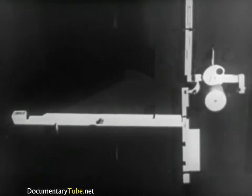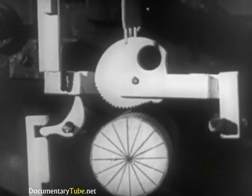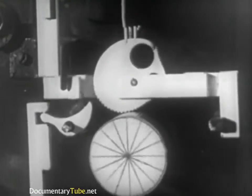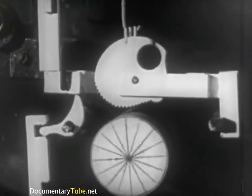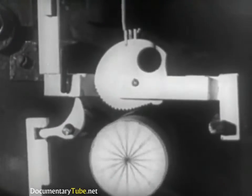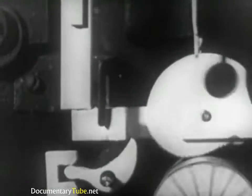Let's observe how the various pieces react to the key. The key moves the lever to which it is joined. This lifts the key bar. In turn, the key bar activates the trigger whose function it is to support the frame with its corresponding eccentric cam. The motion of the trigger allows the frame to lower itself so that the cam revolves around the rubber roller which rotates continuously. The rotation of the cam lifts the end of the frame. This raises the long key rod which causes the release of the matrix from the magazine.